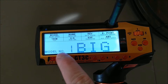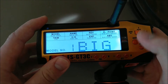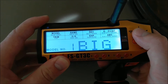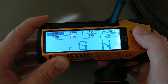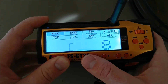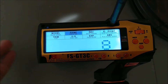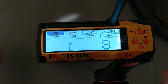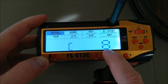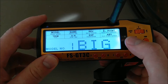First things first, go to a fresh model profile. If this is your first time with a hacked Flysky radio, in the main menu hold down the button and scroll over to C — that's the default number of channels. I always set it to eight, because then you can use the eight-channel receiver, but it still works with the six and three-channel ones. So set it to eight and it'll use up to eight, limited by your receiver.